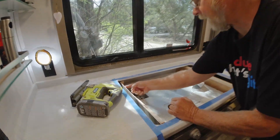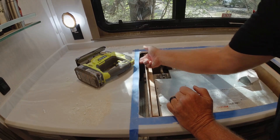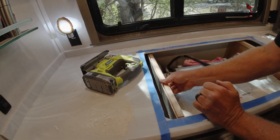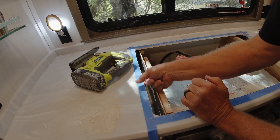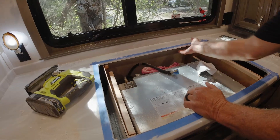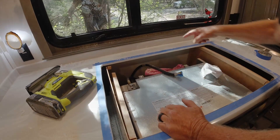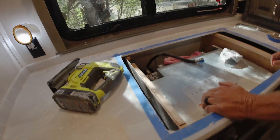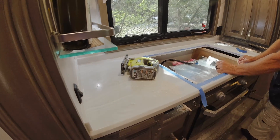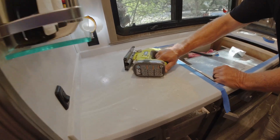We've got to cut this cabinet down a little bit and I'm going to put some reinforcement blocks back in here, even though the factory didn't have anything supporting this at all — this cabinet was not even attached. I will put some 2x2s and glue them in place on both sides. This front is already supported because I cut right up against the rib. The back I'm going to have to cut a little bit to fit our exhaust vent for the oven. The factory doesn't heavily support this because it's lightweight — it's a half-inch stack. They just cut weight where they can on these RVs to reduce gross weight.